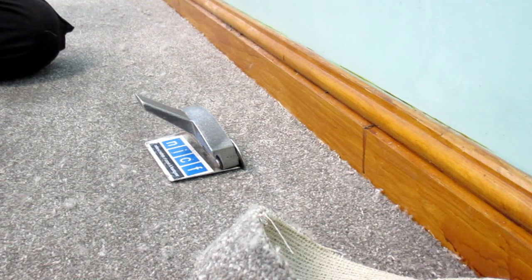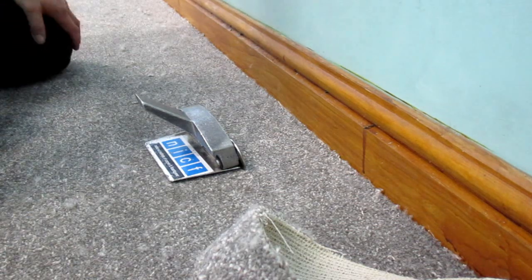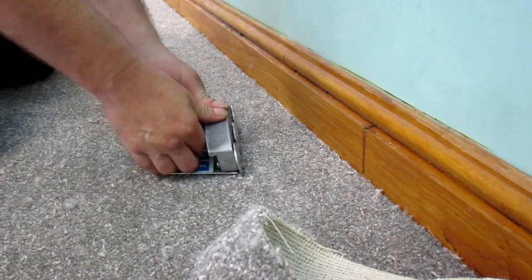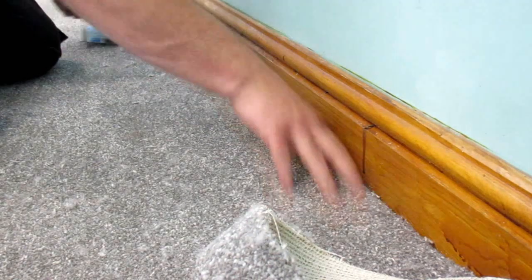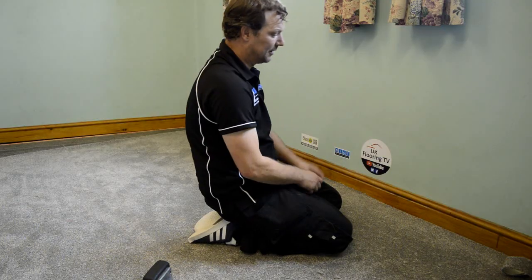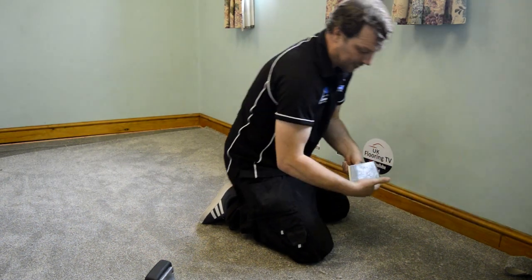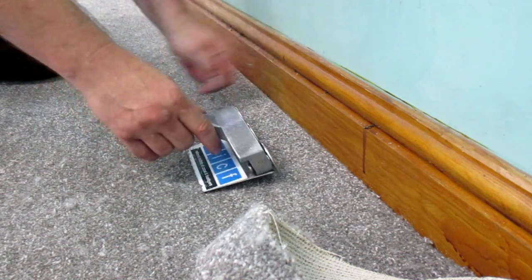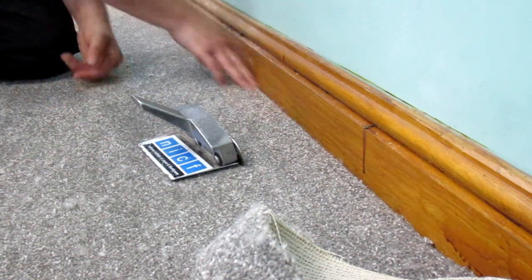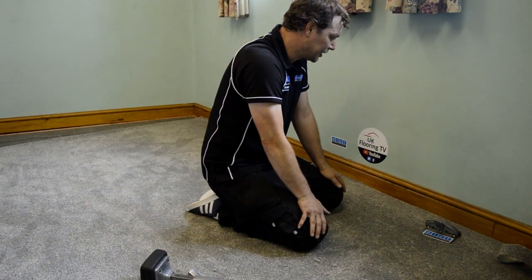Do you want me to give that a little bit of a tuck? Yeah, tuck a bit with the Speedcat and then we'll have a go with the Roberts tucking tool. I'm left-handed and I find using it like that is perfect. It's got a graduated tuck — you're coming in, the first wheel pushes it a bit, the next wheel a bit more, and the last wheel gives it the finish. Leaves you with a nice edge — you can finish it with an awl in the direction of the pile to get it looking crisp.